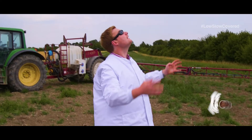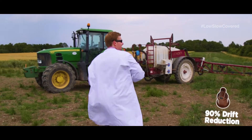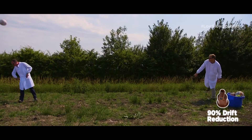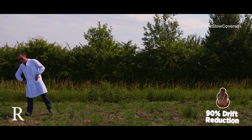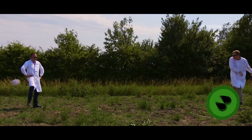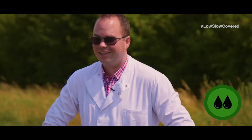Footballs represent big coarse droplets from 90% drift reduction nozzles. They always hit the target soil surface, and at a water volume of 200 litres a hectare, coverage is great and results for black grass control have been excellent. The spray dudes give these nozzles a great green for go.